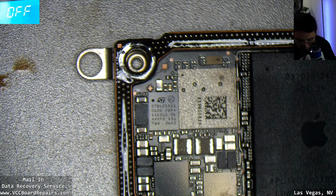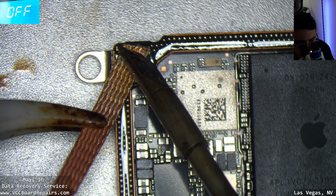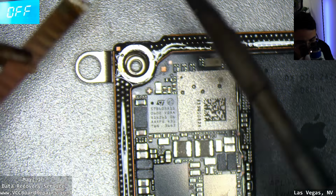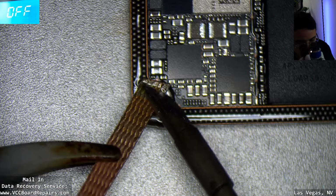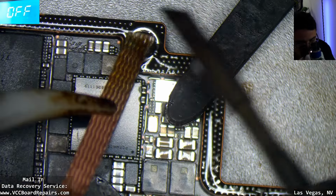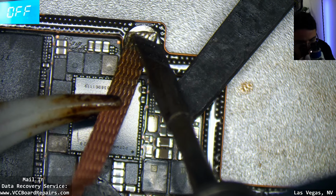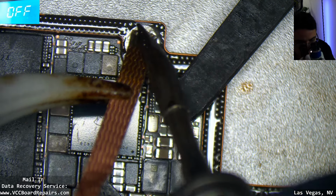I have many videos on my channel showing how to reball it. The most recent one is a 14 Pro Max. I recommend you watch that as far as the best way to reball with the stencil. In this case, we don't have a stencil, so I'm just rubbing solder on here and hoping for the best.